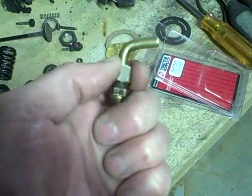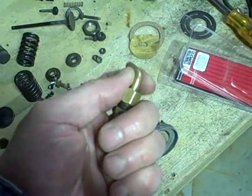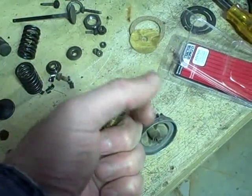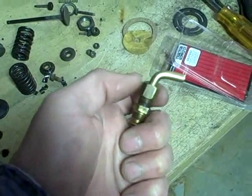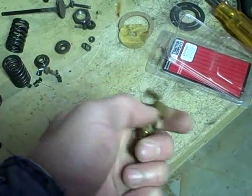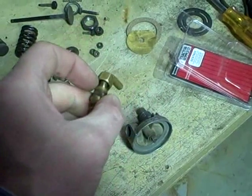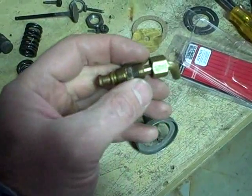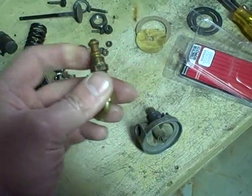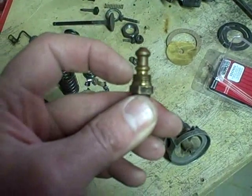Now in my case it was leaking pretty badly, but this nut was very very loose. So at some point when I was reaching under there, or whoever was reaching under there — who knows how long it's been like that — when I went to unscrew this, this nut loosened. And there is a packing inside there; the packing also seals the fuel and keeps it from flowing out. But the packing is almost the secondary sealing surface. Your main primary seal is this seating right here, like a valve seat.